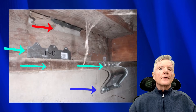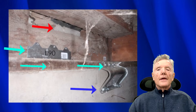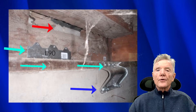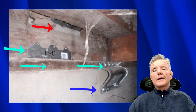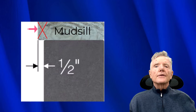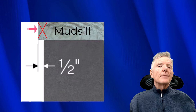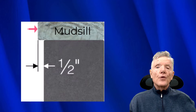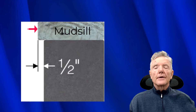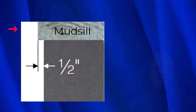That's how the whole system works, and these are a lot cheaper and easier to install — they're an incentive for homeowners to retrofit their homes because they're just so much cheaper. Not only will the URFP work if the mud sill is flush with the foundation, but the mud sill can even stick out a full half inch, which is something the Type B connector certainly can't do. This is one of the ways the URFP Type A foundation connector is superior to the Type B connector.